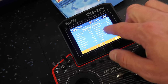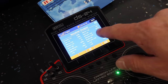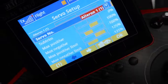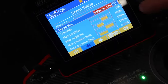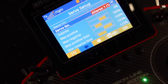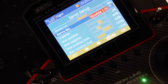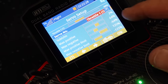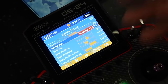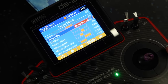So I'm gonna do some mucking around here and mix our channels up and put our primary controls in the first channels. The only downside to rearranging all the channels is your positive limit, subtrim, and all that stuff doesn't transfer over. When I look at these channels here, 80 and 90, 64, 125, those are all things carried over from the previous channel. So what I need to do is zero all these out, and then we'll have to go back in and program these things.